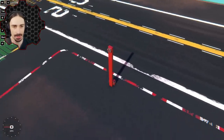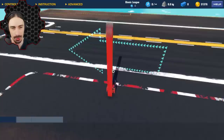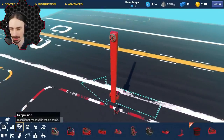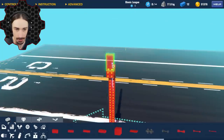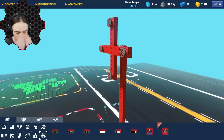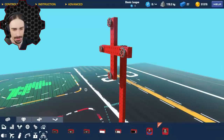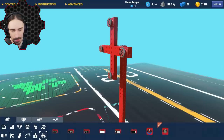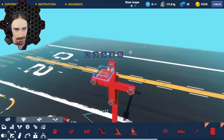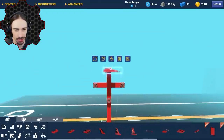I'm starting with a stand on which I'm going to build the basic motor. Step number one — smooth sailing so far. Obviously it is going to be much more complicated than this. Let's start building out our frame to attach all of these wings. Oh no, I just realized there's something I didn't even think of until just now — the counter torque. If all of these are rotating in the same direction, there's going to be a massive counter torque rotating us in the opposite direction. I could have the front and back ones rotate in opposite directions — that should work. This is already more complicated than I was expecting.